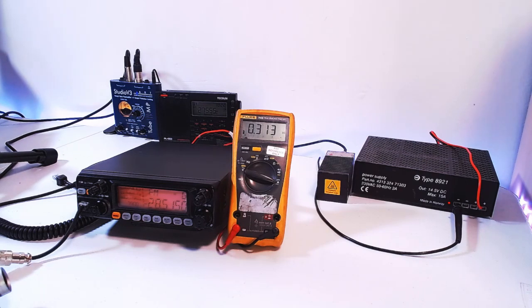Meanwhile, Nick, I hope that's answered some of your questions. And the advice for the power supply is, okay, this is overkill. A 15 amp supply, 10 amps would be satisfactory. In all honesty, I wouldn't go much lower than a 10 amp supply, a good quality bench supply. As Fred in the Shed has been using, he uses his 9600 with one of these LED power supplies that you can get off eBay quite cheaply for about £10–15. I think that's a 10 amp supply, and that seems to work pretty well. So it depends what your budget is, from £10. This one I paid about £50–60, and then you get the proper variable bench supplies, which can set you back £100 plus, depending on your budget. But that's it from me.